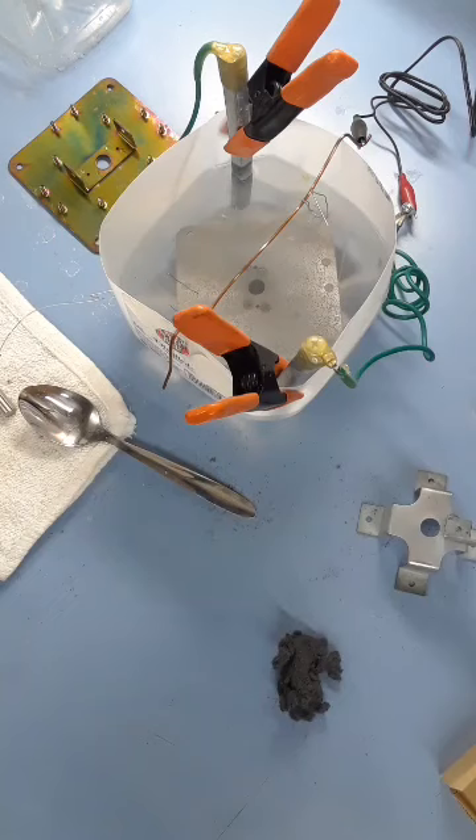The guy was using table salt and a little wall wart — and go for it. These clips do nothing except hold the zinc anodes away from the part. I was plating in this — I think this had nuts in it originally. One quart is what I've been using, and then today I needed something larger.